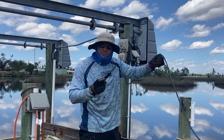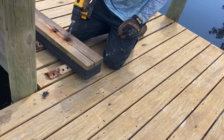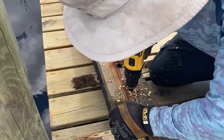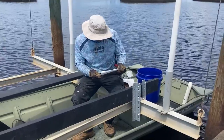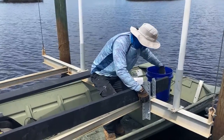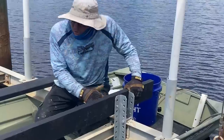We found this knife at a place where we fished, so this has been recycled as well — we found it, it was free. I laid the old board on top of the two new boards, and rather than trying to drill them while they're on the I-beam, I'll go ahead and pre-drill them so the holes will be set. Just making the hole a little bit wider so the bolt won't be quite as tight a fit. Look — a man reading directions. Myth debunked. Don't use a flat washer, use a lock washer there. The brackets must be a little different because the holes don't line up exactly. These are farther away from the bend, so one hole will work and the other one won't.